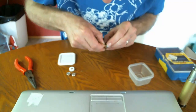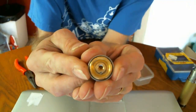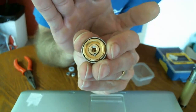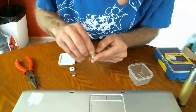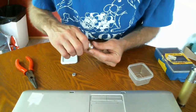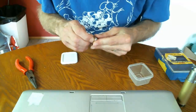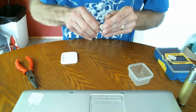Then all you do is just take the pin that you've made, make sure the grooves are lined up, and slide it down in. Now you can see how there's a silver pin and the brass down in the button there. But basically that's how you do it. Then you just take and put your button back together, tighten down on that, put your insulator back, and then your top magnet, which is what makes your button pop out.